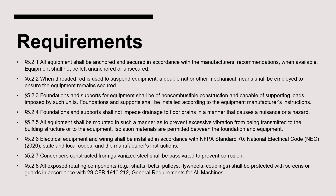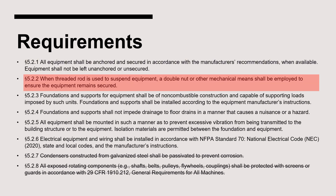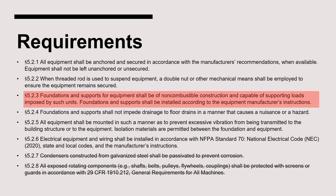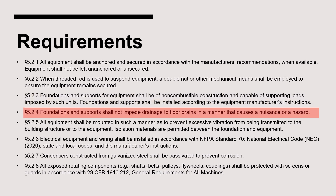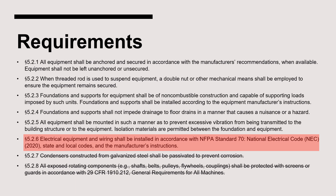The requirements on this page are applicable to all ammonia refrigeration equipment. All equipment must be anchored and secured. When equipment is suspended, double nut fasteners must be employed. Foundations and supports must be non-combustible and designed for the load they will carry, and must not impede drainage to floor drains. Equipment must be mounted to prevent excessive vibration. Electrical equipment must conform to the National Electric Code; for pressure vessels, this would apply to any float switches or solenoid valves.